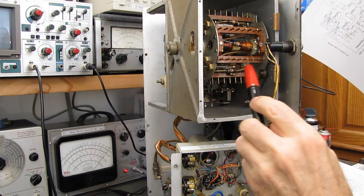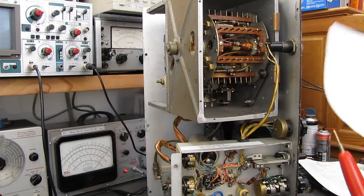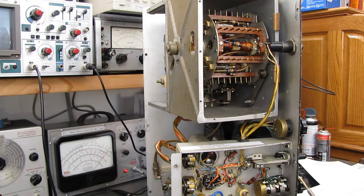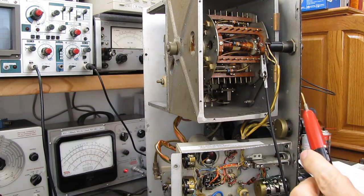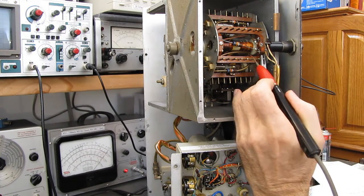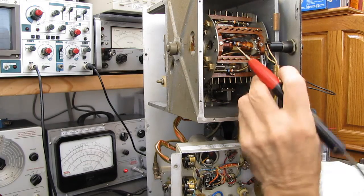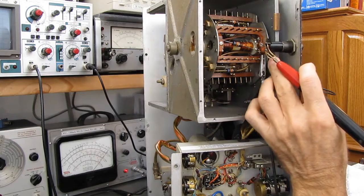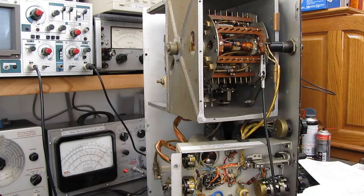So this is the band we're working on. Then we'll go down here and check the continuity of that. Is that right? Yes, that's right. Okay. Don't let me get lost, guys. Keep tabs on me, alright? We should have an inductor coil between there and here. What do we got? Oh, these 2 pins here. I had this wire in the way. I didn't see the next pin. There's pin 2. Yes, we have continuity there and there.